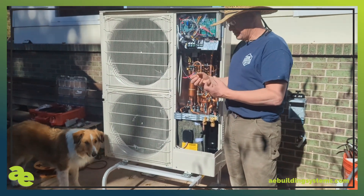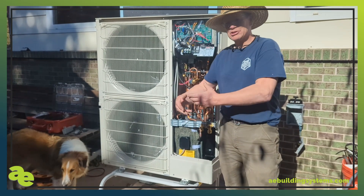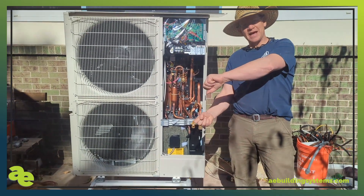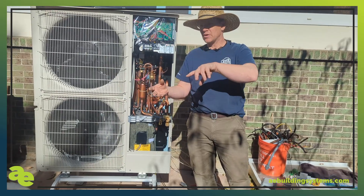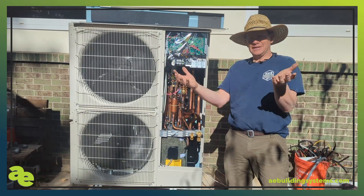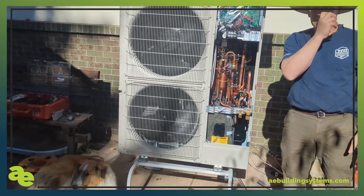We're not burning fossil fuels to make heat — we're just moving heat from one place to another. It uses electricity to do that, but it does it about three times as efficiently as just using electricity to create heat directly. It also cools: we can use the refrigerant to pour heat out of the house, and instead of making the outside air a little cooler, we're making it a little warmer. Heat moves, not cold — a heat pump moves heat from one place to another, pumping it inside in winter or outside in summer.